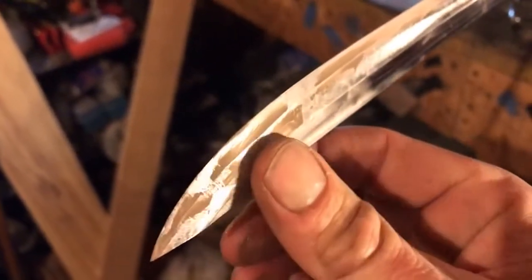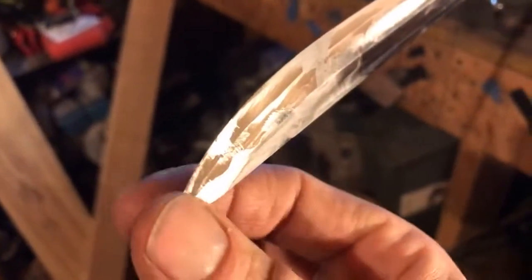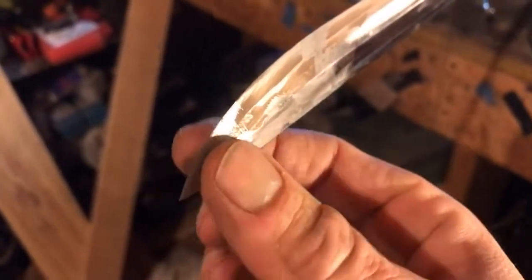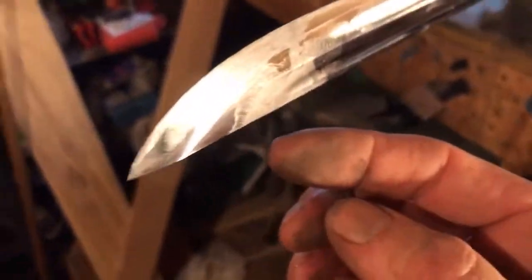This is sharpened up to 1000 grit. I'll do just a little bit more work off camera, so I don't have to worry about looking at the camera and making sure it's charging and all that stuff. That tip turned out real nice. When you wipe things off, make sure you wipe away from the blade. There you go. You can see some swirl from that 1000 grit.